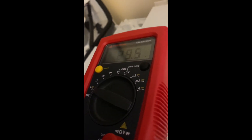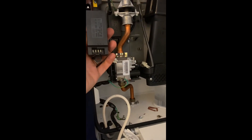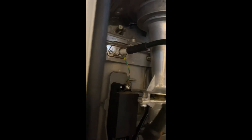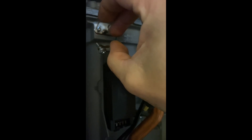In the next clip you can see 240 volts there again. I've got the replacement part here. Power off — obviously electrical safety checks done previously. Nice and easy, take the cable out, undo your screw. Obviously don't lose your screw — hopefully you get one in the new kit. Make sure you put the IRF cable back in on its little clamp, otherwise you will get errors down the line. Screw out. Take your unit out.